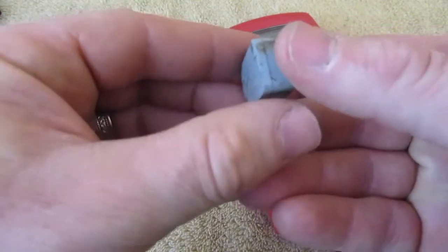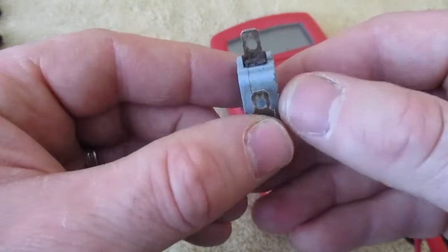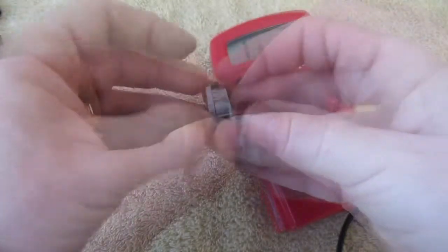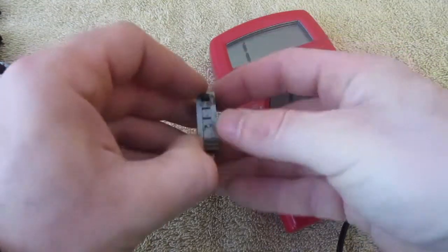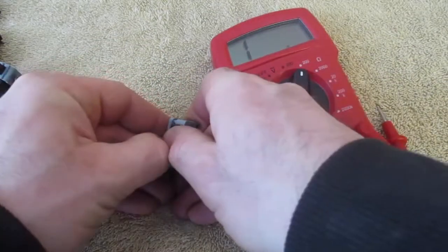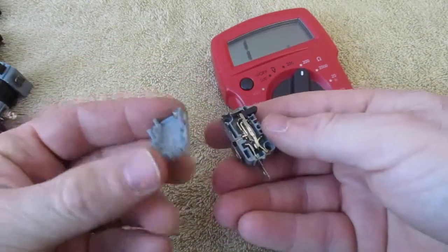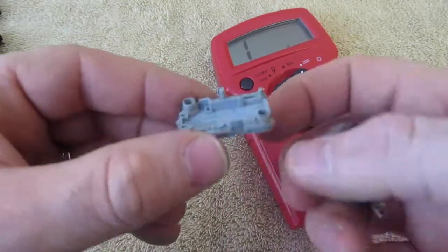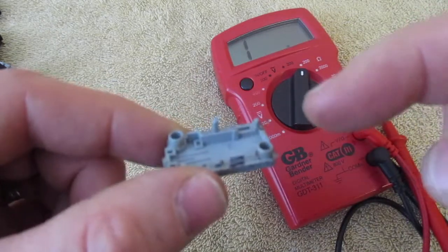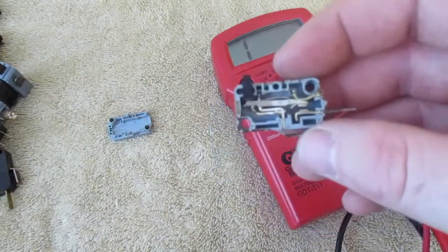If you look here, you can see there's a little line right here. If you can get your fingernail in there, or a knife, you can kind of pry that open. You're not going to open these if you're just testing yours — I'm just going to show you how they work. The cap is basically held in with a couple of prongs, and it just slides into place. So here is virtually the whole inner workings of a micro switch.